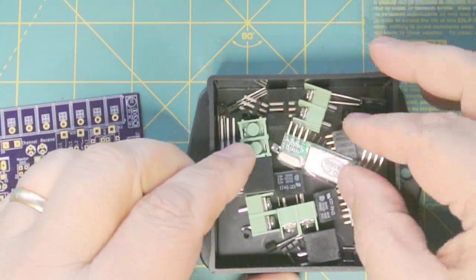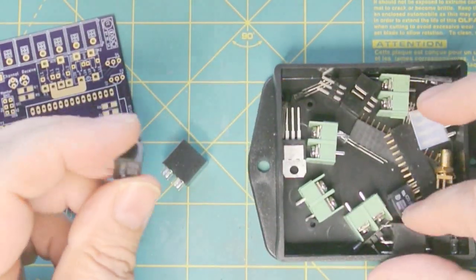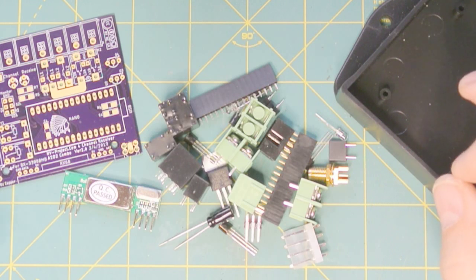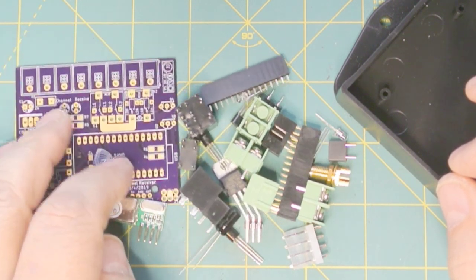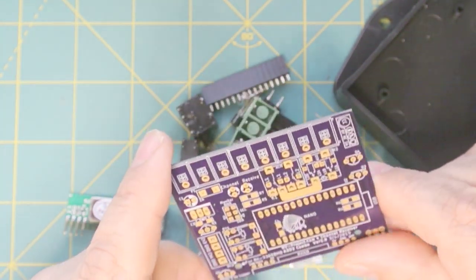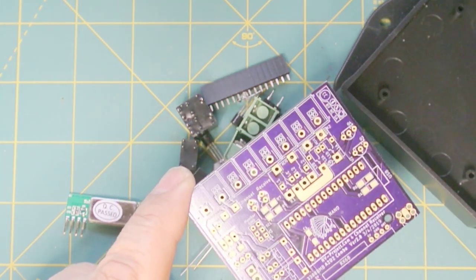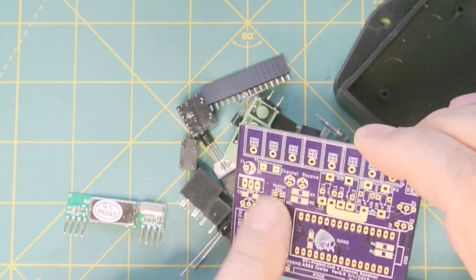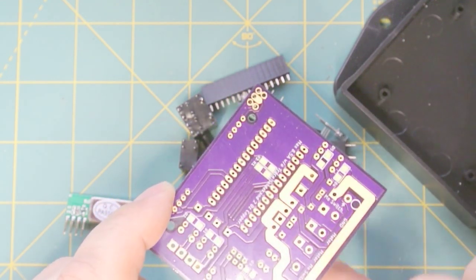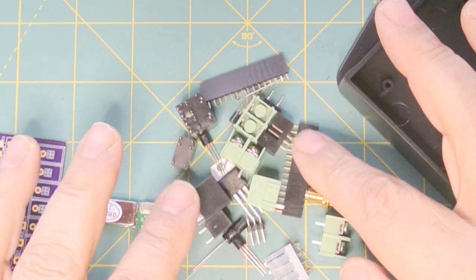Here's the whole little box of parts for the receiver. We have the main circuit board, a fairly high quality receiver, and then we have the relays for the motor control for the awning plus for the dimmers. And on my website I'll have step-by-step instructions on how to place all the components. One thing we have to talk about on this board is that you have to specify two ounce copper when you order it. From OSH Park you can get one ounce or two ounce copper — that's one ounce per square foot or two ounces per square foot. Two ounces is twice as heavy as one ounce and it can handle more current. We're also going to put some solder on these traces, which will actually make the traces thicker. This will handle up to eight and a half amps, so that's pretty respectable for a small board. So without further ado, we're just going to assemble this board and then we'll show you what it looks like.